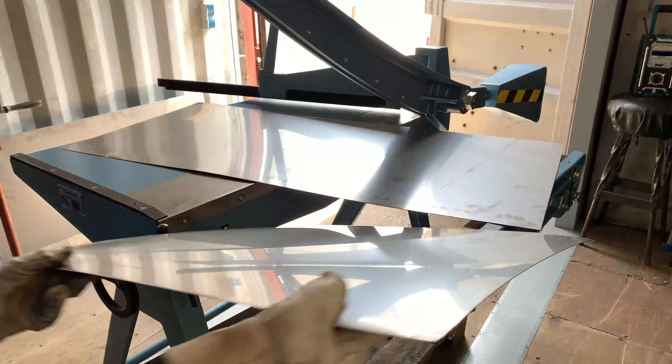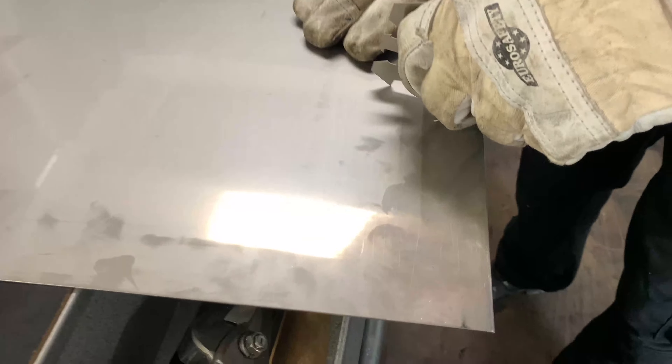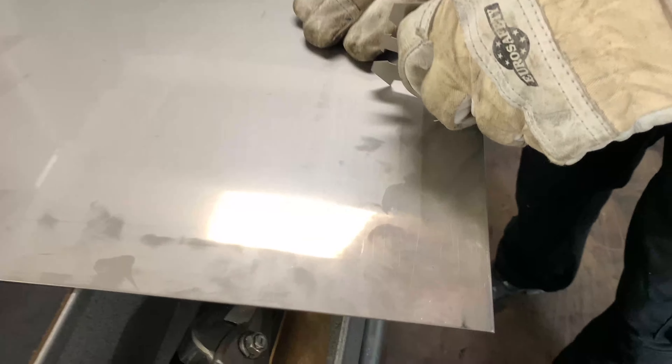The top — we're going to cut out the four edges and bend them 90 degrees up, and then also make a hem or beading bending — I still have problems expressing myself in English on that term. We're going to go 60 millimeters. We need to see which side is inside and which is outside — it doesn't really matter. We're going to do 60 by 60 millimeter in each corner, and then I'm going to have 15 millimeters overlap, so 45.